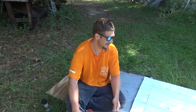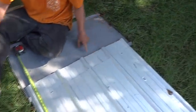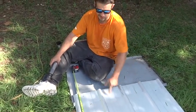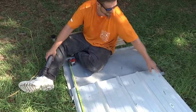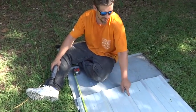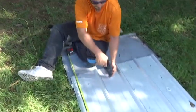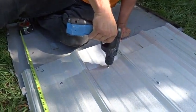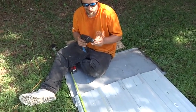What I've got is my seven-inch piece connected to my full piece — already got two screws in for starters. You want to put this metal down as flat as possible on something flat; I was doing it on concrete yesterday and it worked great. I'll put another screw here and another one here. We'll attach four more once we get up on the roof. I'm just putting these in now so I can get it up there, then once it's nailed down we'll attach the rest so water doesn't get underneath. Just got my self-tapping screw — that's how that goes.